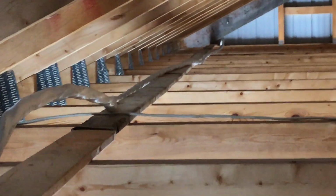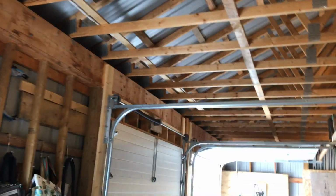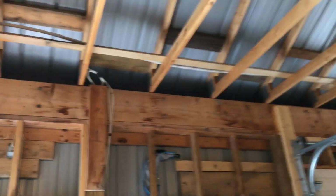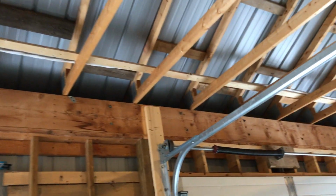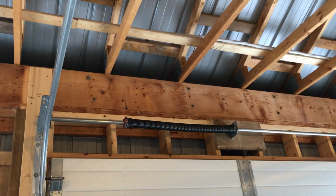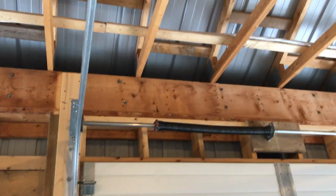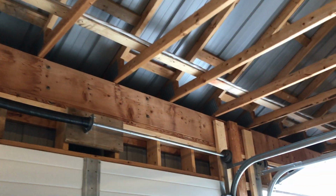and then you want to fasten it on top of this wood all the way down, right? That makes sense, doesn't it? Anytime you run any sort of wire, it needs to be supported, right? You can't just have a wire dangling from rafter to rafter or ceiling joist to ceiling joist. Anytime you run wires, even in an attic, they need to be properly secured, not just dangling. So that's what I'm gonna do.